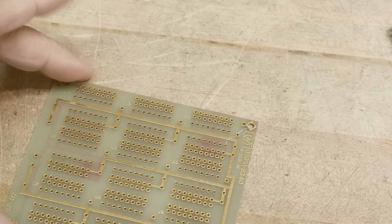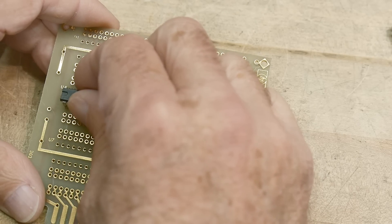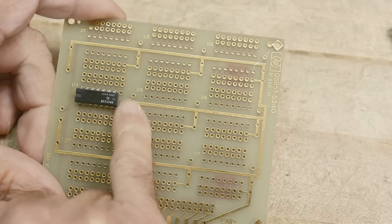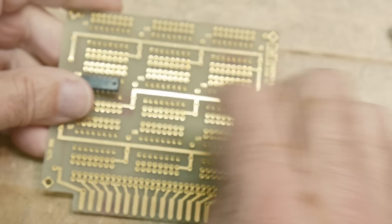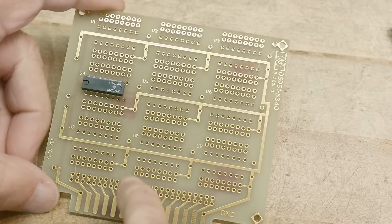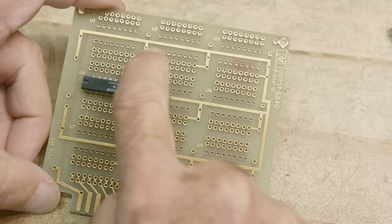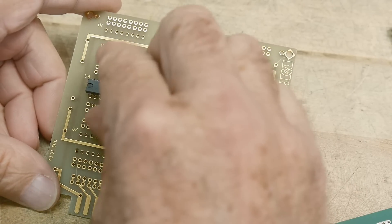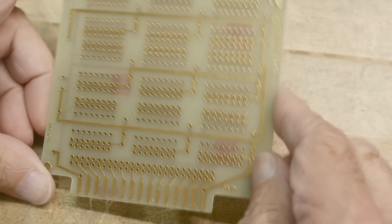There were other cards in the stockroom. There was this card, which was also made for DIP parts — a DIP part would go in there. There is a ground connection and a five-volt connection, so those are routed around on the board. There are places for bypass capacitors on the rails. So if you have just a strict TTL-type circuit, this is a good board.